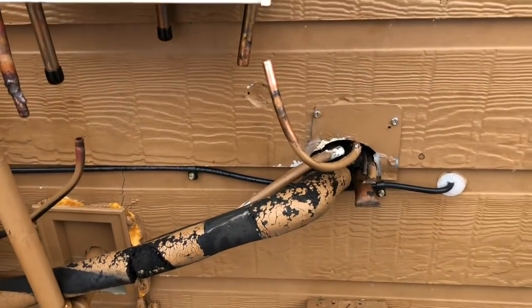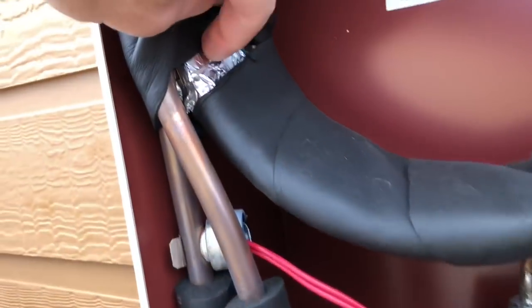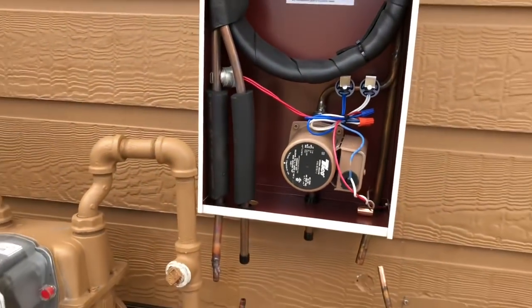The line goes into a crawl space that runs about 20 feet in a straight line, so I'm not going to use the Airfox unit. I'm also concerned that it's really just two pipes next to each other wrapped in about three wraps of tinfoil — I don't see that being super efficient.